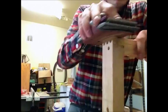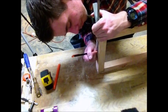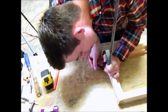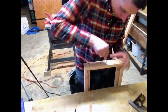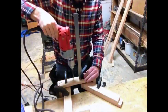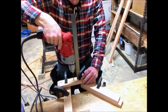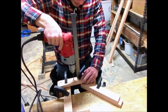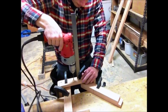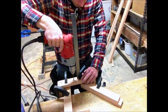I start my repair by sanding down any protruding edges for an accurate measurement. I then measure 4 and 9/16 to the right and 1 inch down for the proper placement of the attachment hole. I mark the hole and use a 7/32 inch bit for the pilot hole. Since I don't have a drill press I use a square to aid in drilling a perfectly vertical hole. Sometimes pieces won't fit on a drill press and this is a good trick to use if that is the case.